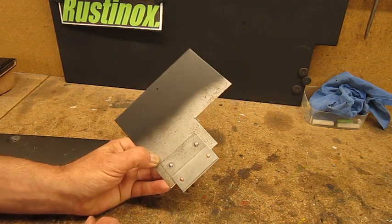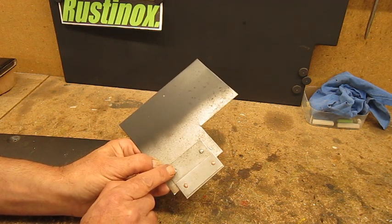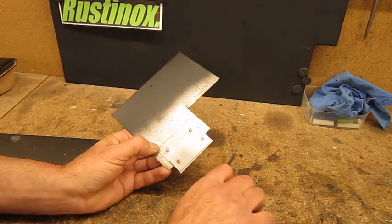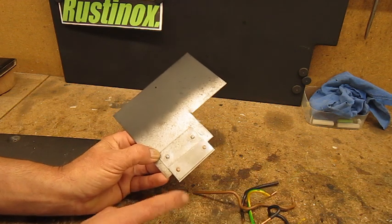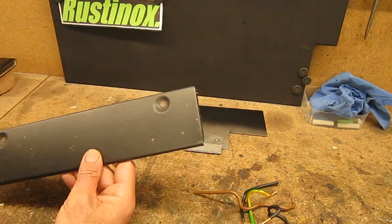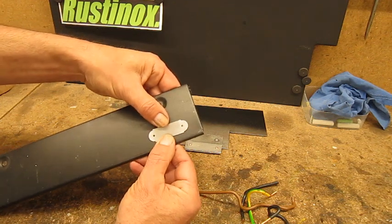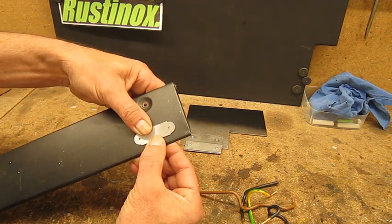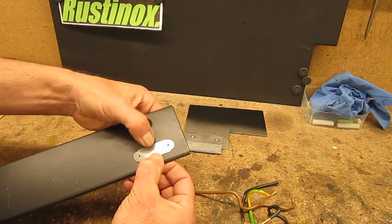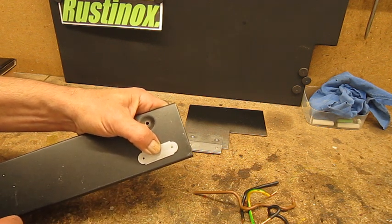As you can see, I already started to play around a bit. These two are these soft steel rivets from the black box I showed you, these very small ones. And these are rivets I made out of electric wire. Very easy to do, I will show you. Now I think this is a nice way to put, for example, a label. I made this little label here, and I want to put it on this, which used to be a CD player, but I think something like maybe steam engines or whatever to put labels on. I think it will be way more beautiful to use a copper rivet than to use a bolt and a nut.